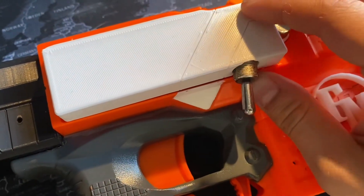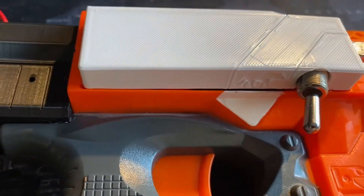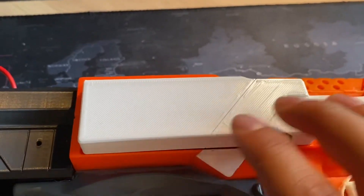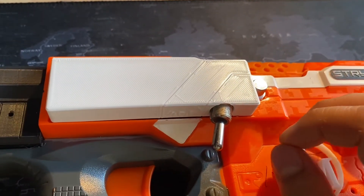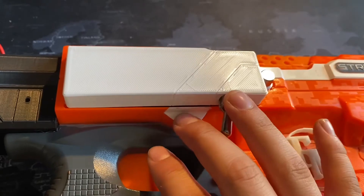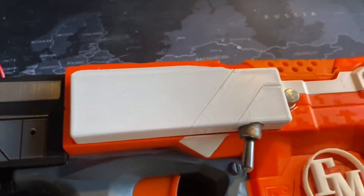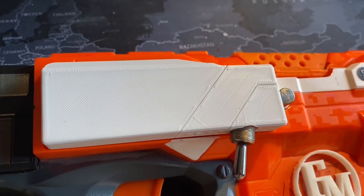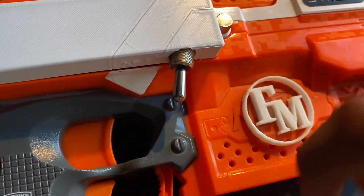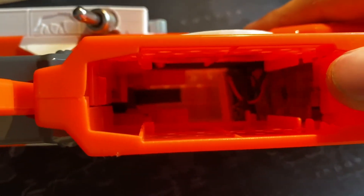It's quite stable without any glue, just because of how tight it is in there. What I've basically done is a pulse generator which makes bursts of electricity, and that makes the solenoid repeat-fire like full auto. That works very well, although you need to upgrade the spring on the base solenoid because it's simply not fast enough to do what you want it to do.